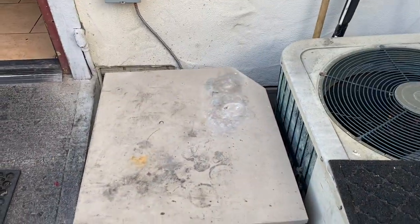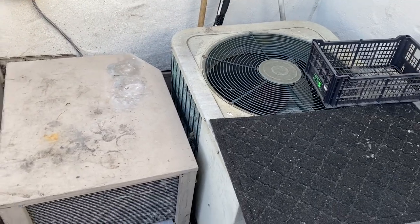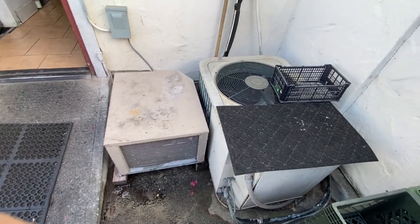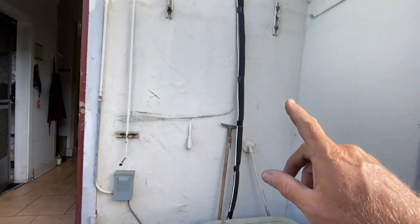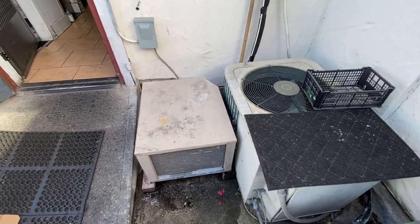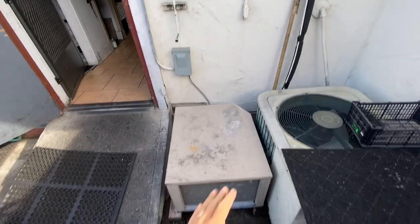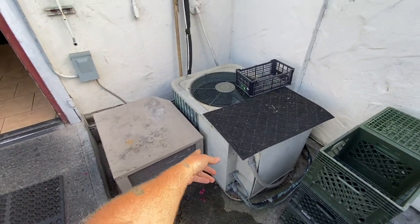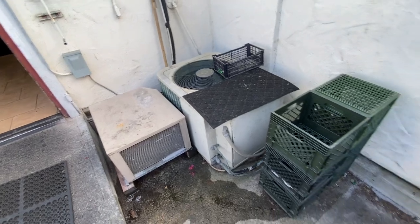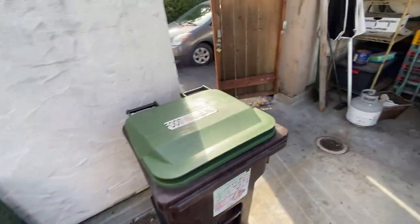All right, we're all pumped down, made it to set point. So that's my hack right there on a leaky coil coming. It's not in stock right now. Patched it up as good as I could and converted it to 448. And when I do that, I don't care about my evaporator superheat. I'm worried about my compressor superheat, the compressor not flooding back, usually is what happens. The new coil, when it comes, will have a 448 TXV, and we'll be all dialed in nice. I still never picked up a leak on that coil, the condenser, so that's weird. It's all pumped down right now at set point, and we'll be waiting on the new evaporator coil.